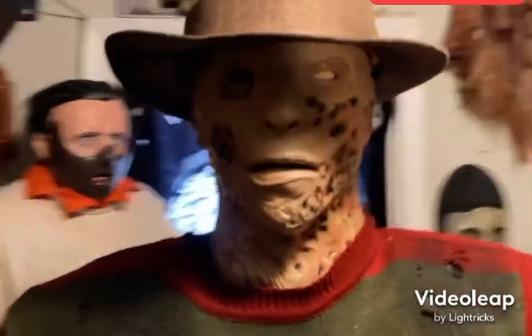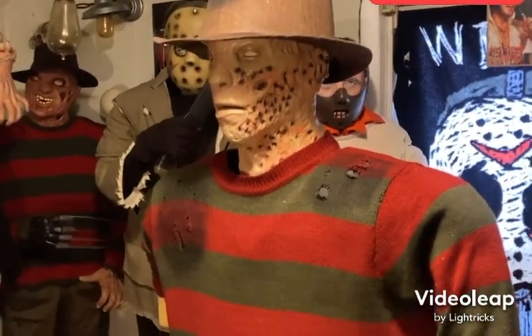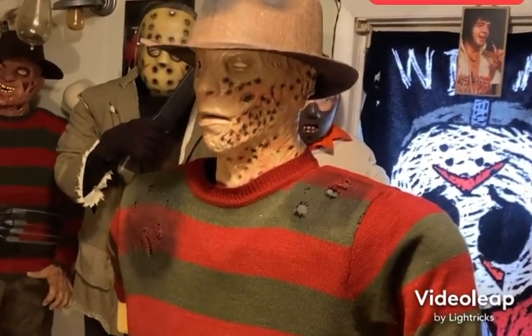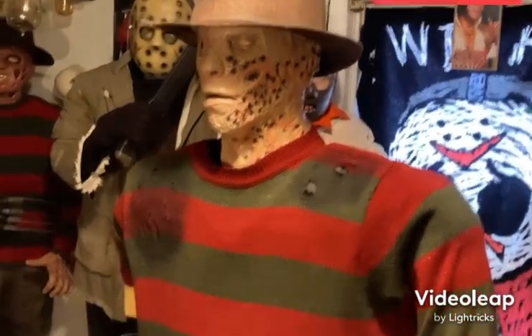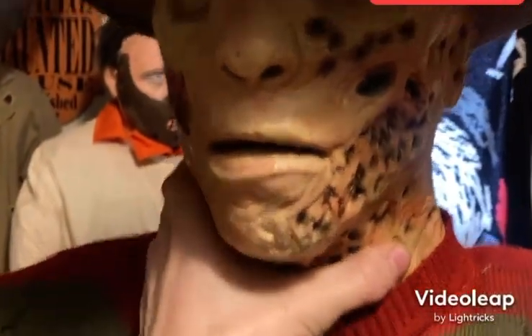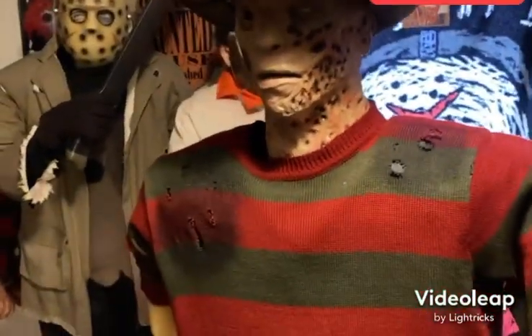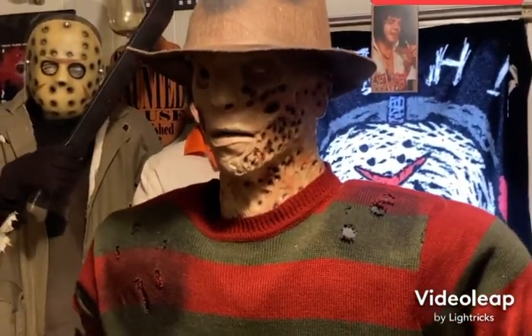I'm going to clean the board, but not as extensively as originally planned since he does power on — just in the spots that need it. Luckily the traces on the board were not corroded with rust at all, because that would have been a big problem. The only thing he doesn't do is turn his head, which is probably a wiring issue. Yesterday we hooked the head motor up to a C battery and the motor did spin, but it's not spinning when connected from the board.